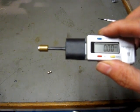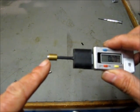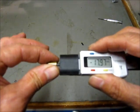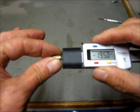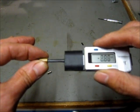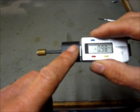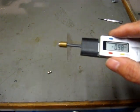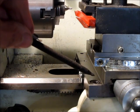What I've done now is turn up a little brass adapter here — one end fits onto this probe and the other is recessed to take the 6x3mm magnet. So now when the thing moves — it's a bit stiff at the moment but I'm sure it'll free up — we've got 20 millimetres of movement here, which I think is probably more than ample for what we need. So all I need to do now is find a way of attaching this part to a fixed part of the lathe and this magnet linked onto a moving part of the cross slide. With these DROs it's important to mount them out of the way of cutting oil and swarf.